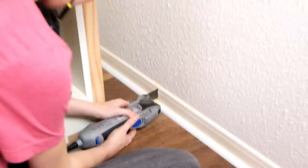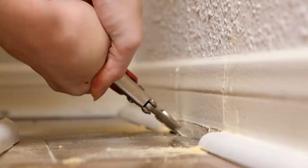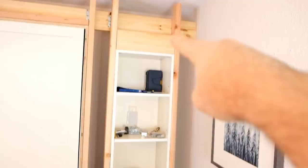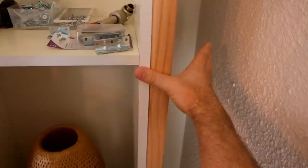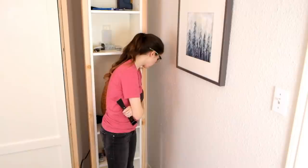It's still sleeping — yes, looks good. But one thing I just realized: we're about to be adding the trim right here. This one's good, it has these two points. This one we're just going to be attaching in here, but there's nothing to prevent this from swiveling in — not at the top, not at the bottom. We gotta add another 2x4. But I bet if we just do a little snap we could just have it done. Wow, look at that — I guess it's time to add the trim.